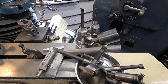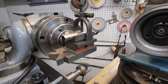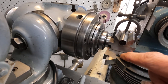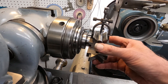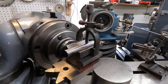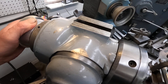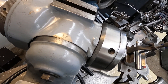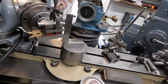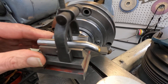Over here I've got what I believe is a Starrett 567 V-block mounted into a collet. The V-block has threaded holes, so I just made a little tail for it to mount here in the workhead. You can rotate it - I swung it around and I can put a square here against it and set it to zero right here on this scale. That gives you your tilt, so it's all really very simple.